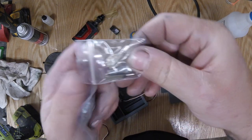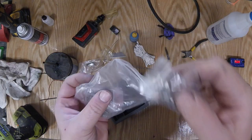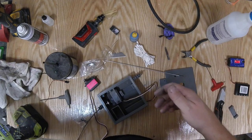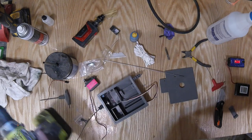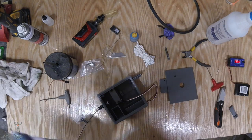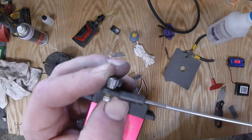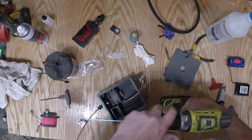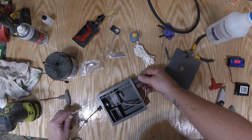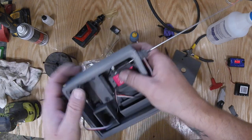Just a note: you might be tempted to use spring clasps — the solder kind for outboard cables — but don't use those on a gas boat for steering, not strong enough. I'm going to take this threaded rod, same drill trick, and give it plenty of threads through the plastic piece. We adjust from the rudder side. I'm going to slide this through our boot — we centered our servo — and see how easy that is.